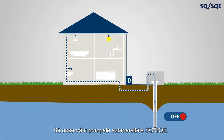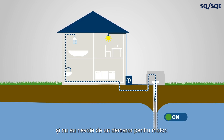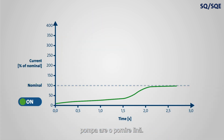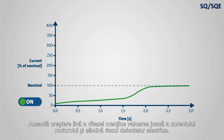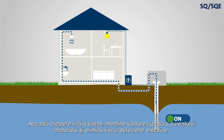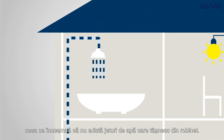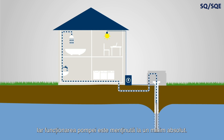Now, let's have a look at the SQ and SQE range. All the pumps in this range have an integrated frequency converter and do not require a motor starter. Due to the features of the integrated frequency converter, the pump offers a smooth startup. The motor speed increases slowly and reaches the nominal value within a period of three seconds. This slow increase in speed keeps the motor current low and eliminates the risk of electrical disruptions. On top of this, the flow rate increases proportionally to the motor speed, which means there are no sudden bursts of water at the taps, while keeping pump movements to an absolute minimum.